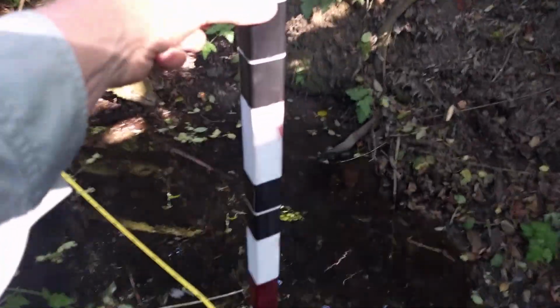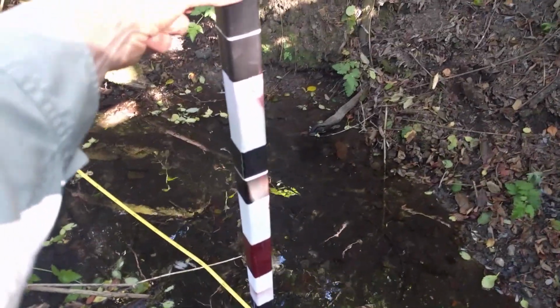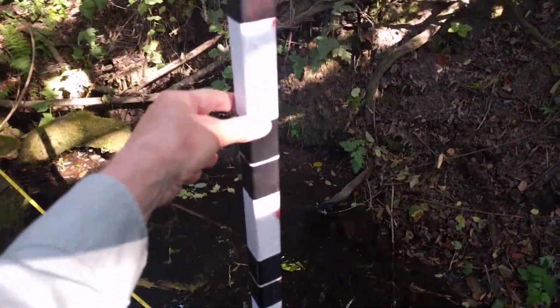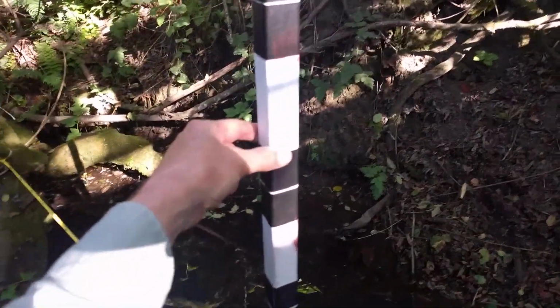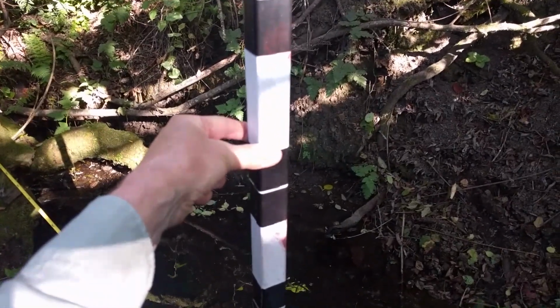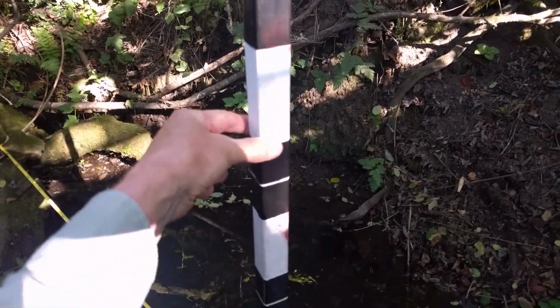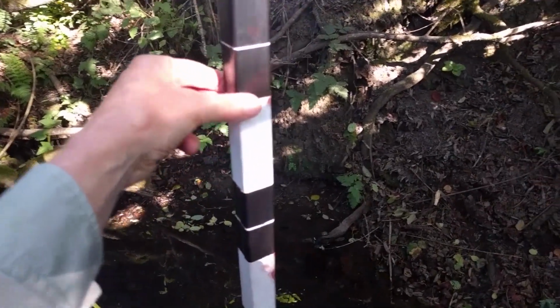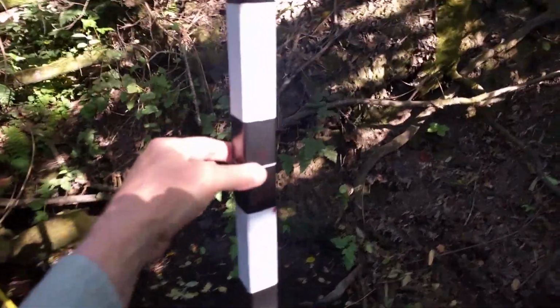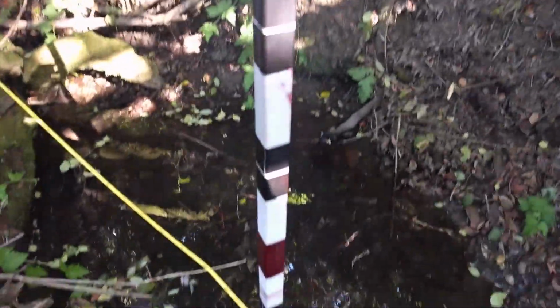Because the person closest to the rod, whether it's this hand-built painted one or one measured off with numbers, in either case it's very useful to ask, is this the point you're looking for, just to confirm that and get a check on it. Right, so that'd be 1.4, that'd be 1.5, that'd be 1.55. And so the person on the rod can pretty easily read those values off.